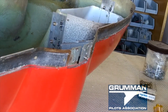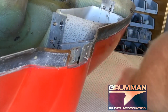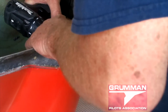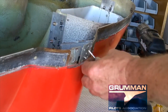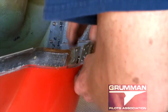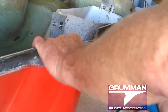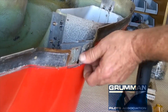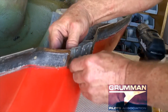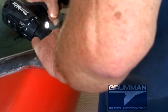Here's how we do the blind fasteners. We use a screw to hold it in place, then drill from the back side to drill the first hole and put a pop rivet in. Now we're ready to take our number 41 drill — because the drill can wallow through fiberglass, that makes a perfect number 40 hole. We take a number 40 countersunk rivet and put it in the hole. These are shear countersinks with very little flange — nothing that's going to interfere with the upper or lower cowling mate. We come back with the pneumatic riveter. We're mounting these at a 45-degree angle so we catch across the grain of both layups of cloth, which also keeps them out of the way of how the cowl mates.